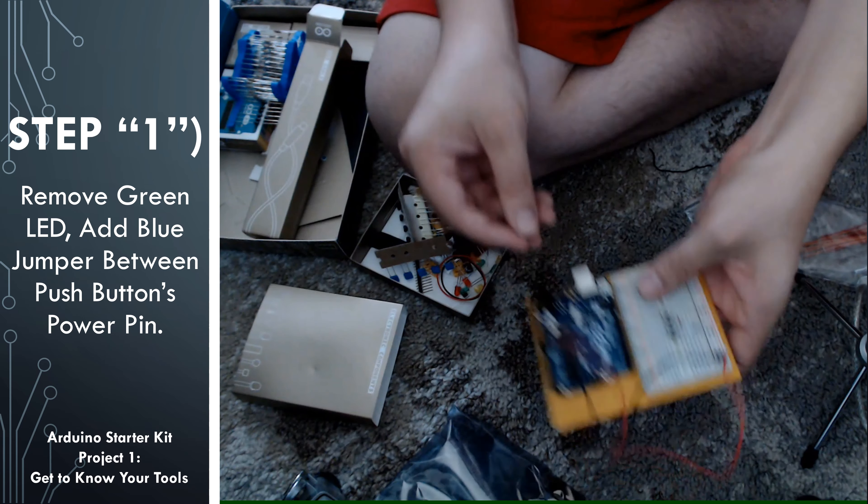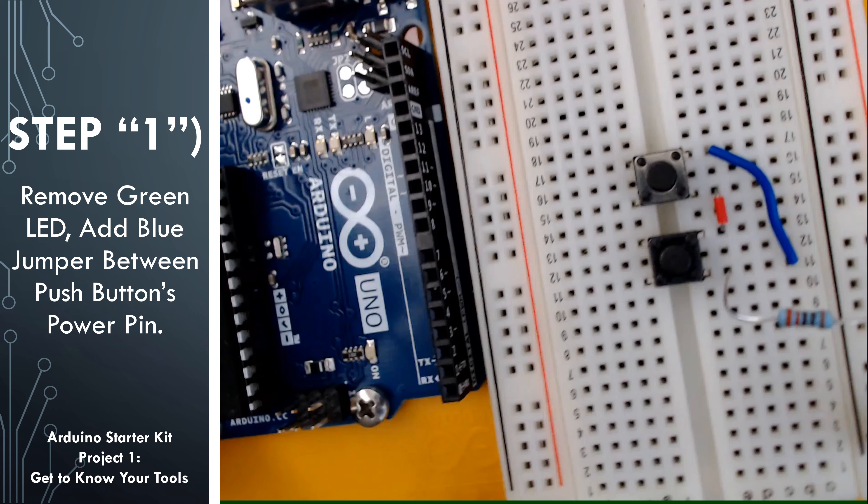This was just a quick fix. I didn't want to have to find the right size jumper wire or move push buttons around to get the current wire to be the right length. But this is good enough. What I'm going to do is modify this circuit as little as possible. Since I already have the two middle pins of the push buttons connected together, it seemed easier to make that the ground connection, and then connect the outer two pins together to make that the positive side of the circuit.